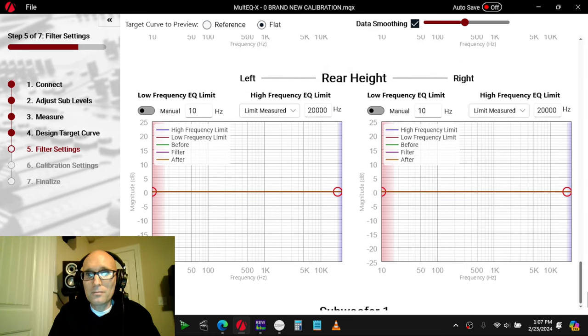Now, whether you use impulse alignment or phase is debatable. I found that phase is actually better for subwoofer calibration, and I'll say that kind of lightly. I'm still dabbling with what the best method is for the speakers themselves, but I think it's phase. And one of the things here is where you place your cursor is important. It will change the response that you actually get.